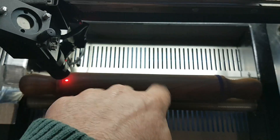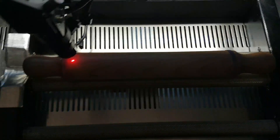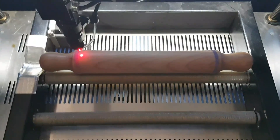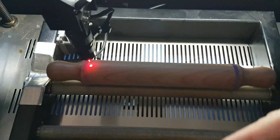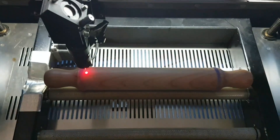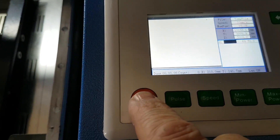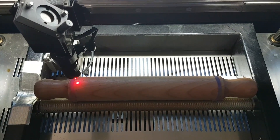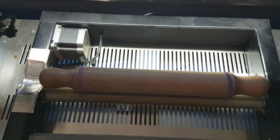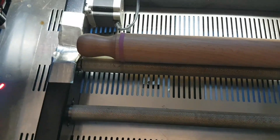You do have to pay attention to get it pretty parallel — I just lined it up to this bar. When you turn the machine on it does its home cycle and rotates the cylinder thinking it's moving the X and Y table normally. To stop it running off, I'll press reset to redo that cycle — just watch the machine restart the controller and start the home cycle. Then I press the Escape key to stop it running off forever.